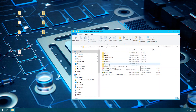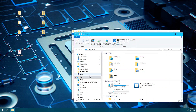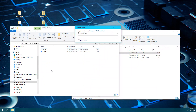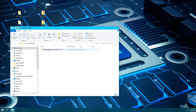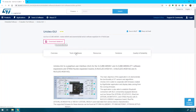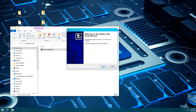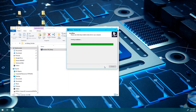From the unpacked XCube-MEMS1 folder, locate the project associated with the Nucleo board you have selected. Drag and drop the .bin file to the Nucleo folder created when your device was connected to the PC. Go to the Utilities folder in the XCube-MEMS1 folder, double-click the HTML file, and download the Unicleo GUI software. Unpack the files and install the GUI software.